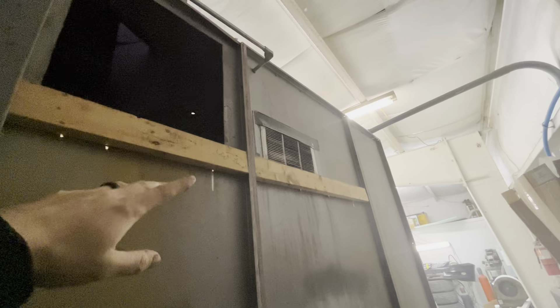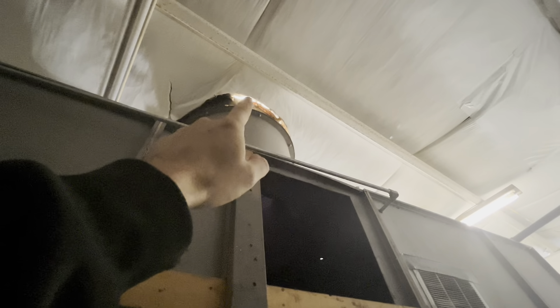I still had the booth pulling too much air, so I actually cut a giant hole out of the back of my booth. When I bought it used, somebody already had this little thing in here to help suck some air — take some suction off the booth — but it was flowing too much. I literally just cut a giant hole, braced it up with some two by fours and screws. It's pretty redneck, but I come from a construction background. And there's your giant stack — you can see what looks like sunlight through there, but it's actually a clear roof sealant poured around that. We had a roofing company come out and seal the stack up that goes through there. So that's the inside of the booth, and this definitely helps kill some of the airflow so that the booth is not sucking so hard.